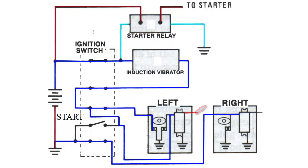You don't get just one spark in each cylinder — you get a whole series of them. That's why they call it a Shower of Sparks system. When you release the key, all those switches open. Now neither of the magnetos is grounded, which means they are both on. The normal points now control both the left magneto and the right magneto, and the aircraft just runs normally from there.